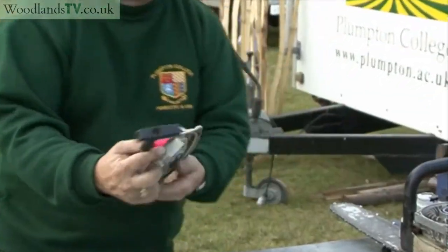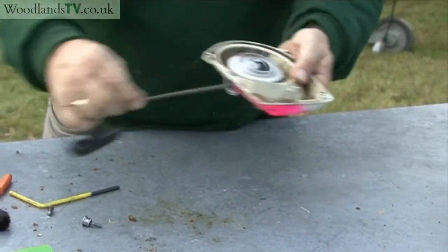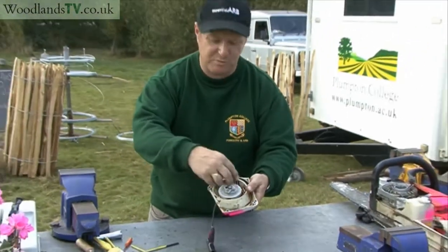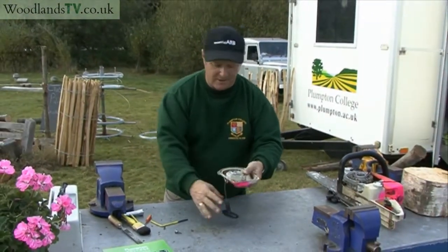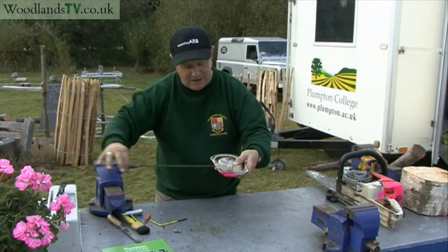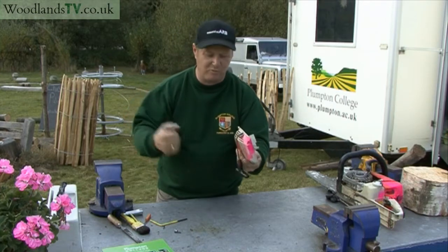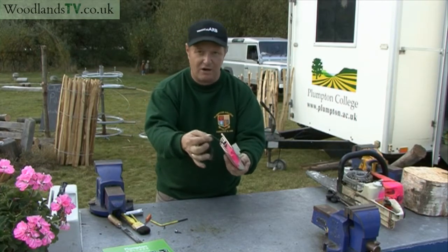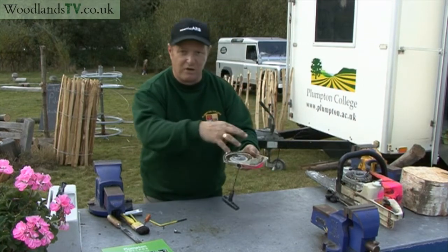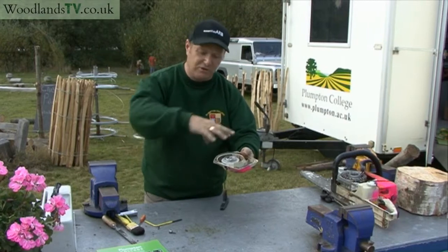On one side underneath you have a nylon spool with the cable cord wrapped around it, and underneath the nylon spool is a clock spring. As you pull the cord out it winds the spring up, and when you let it go the tension comes off. If you leave the cord hanging out like that it makes the saw much more difficult to start, and it will get caught on things when you're using the saw, making it dangerous in the woodland. So we just need to put a little bit more tension back on that spring — effectively we're going to wind it up.